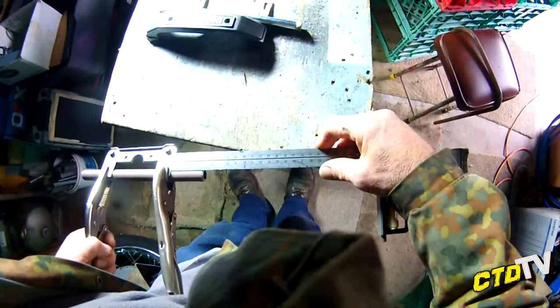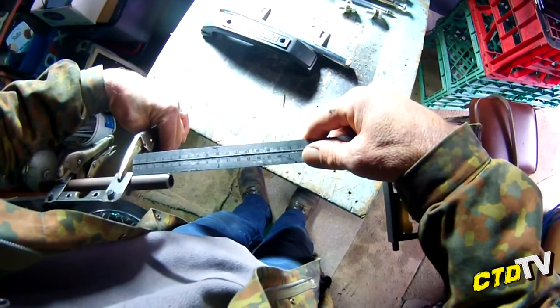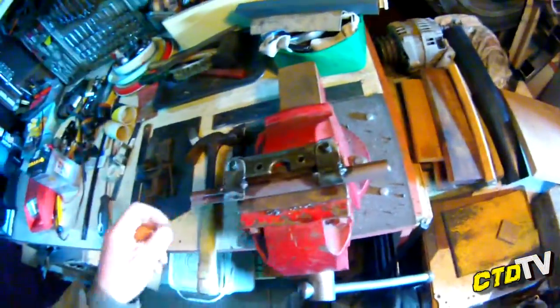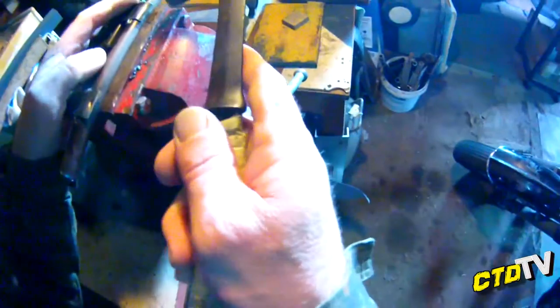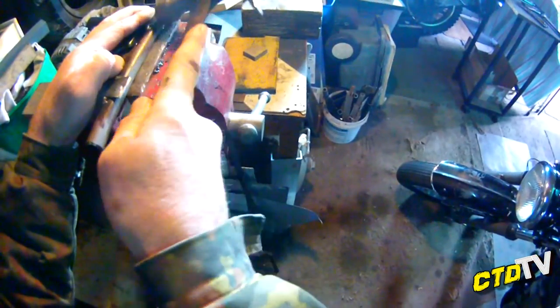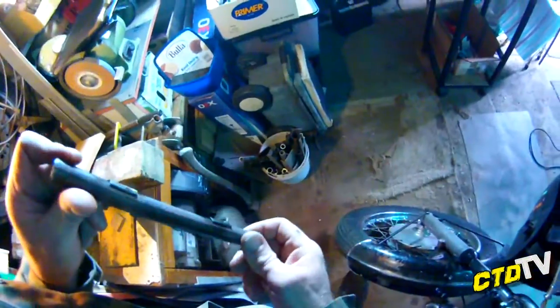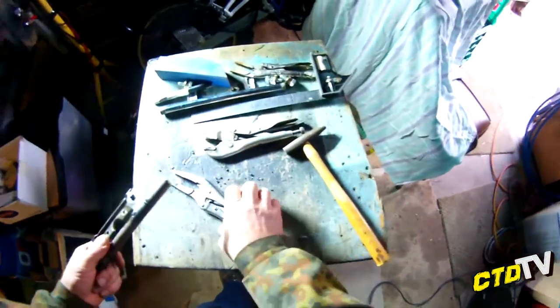Distance is 47mm. I've tack welded them on and now what I'm doing is I'm just bending the tags around to tack them on more and put it off as a cradle as well. That's pressed up against nicely. Now we tack it on a little more.